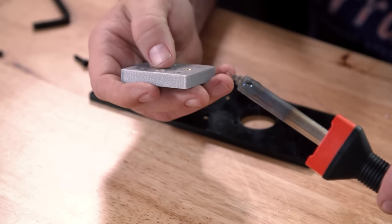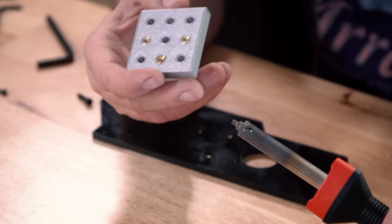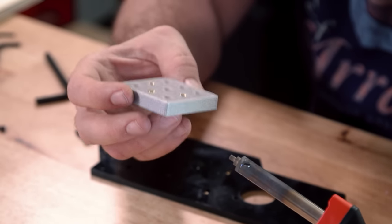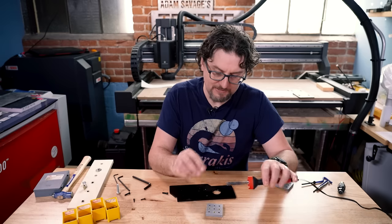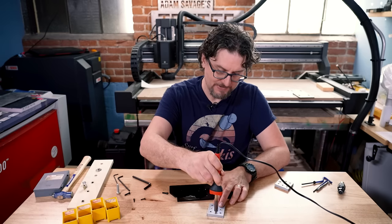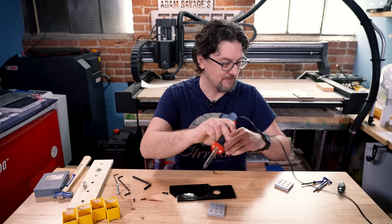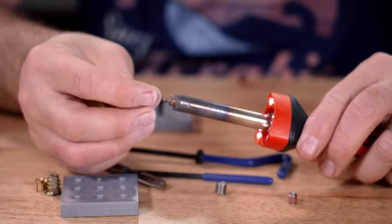That's going to be pretty hot right now. I'll let it cool a little bit and the melted plastic will cool around the knurls so it won't come out. Sometimes if I want a little bit more additional security, I will dab the soldering iron just around the rim to kind of melt a little plastic over the edges, but that's not always necessary.